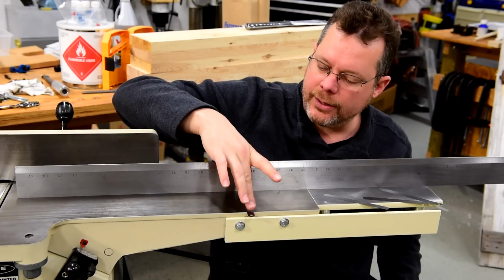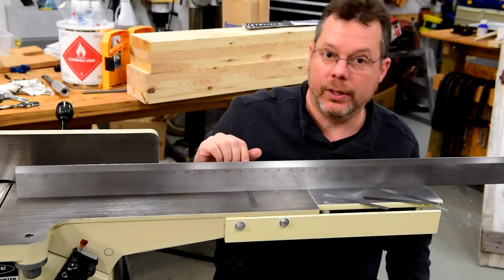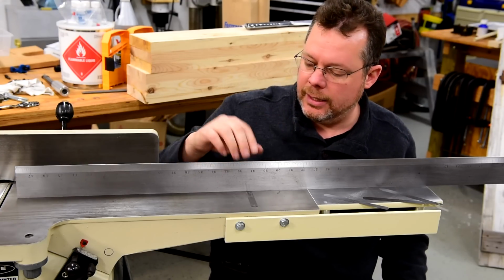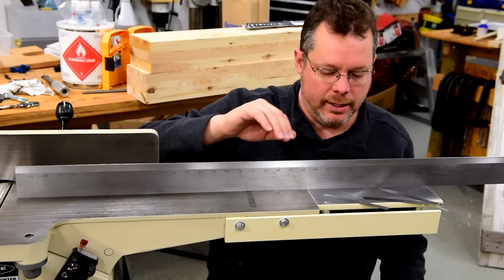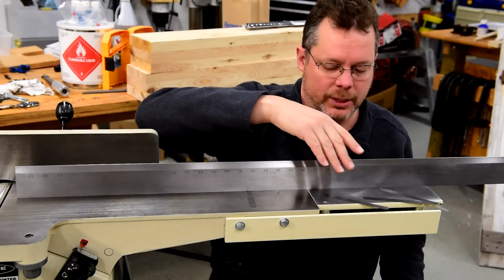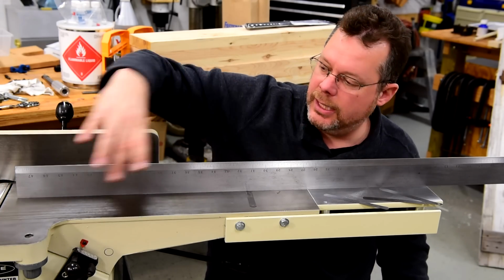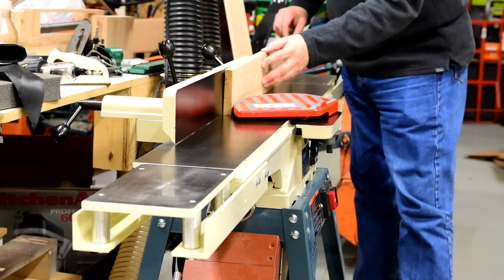And 3/1000ths, not much of a gap, but a gap nonetheless. But it doesn't really affect the accuracy. 3/1000ths of an inch doesn't affect the accuracy too much of the bed. But it does make a difference when this plate is not made parallel with the two ends of the table that are straight. A final test cut.